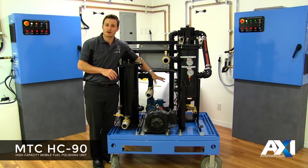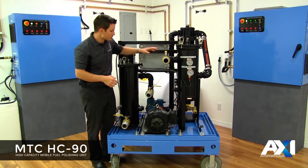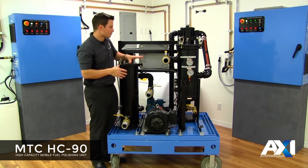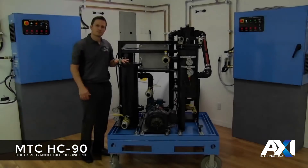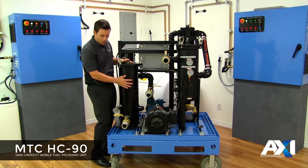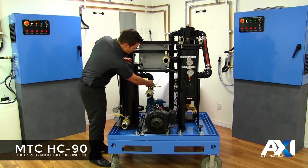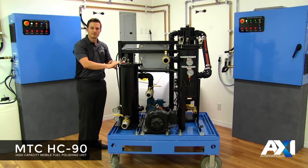This is a mechanical water separator that removes water from the diesel using the higher specific gravity of the water. The water will collect in the bottom sump and can be drained by the user whenever it fills. There is an actual set of probes on the side that detect the difference in conductivity between the water and the diesel, and that will alert you on the controller as to when you need to drain the water. When you're ready to do your fine filter polishing, you can either do a water removal or use actual fine particulate high efficiency media. You'll want to close off discharge port one, and it moves from the top of the pump down through the magnetic conditioner into the fine filter vessel.